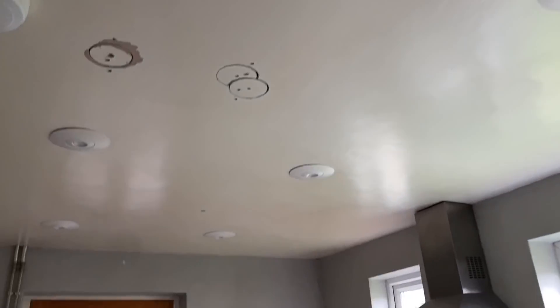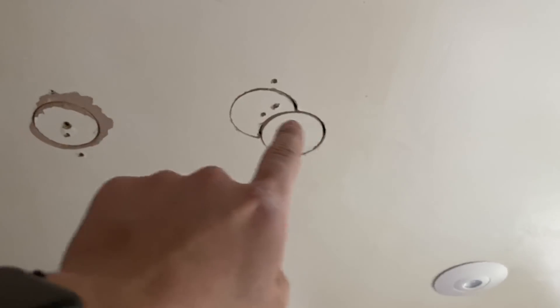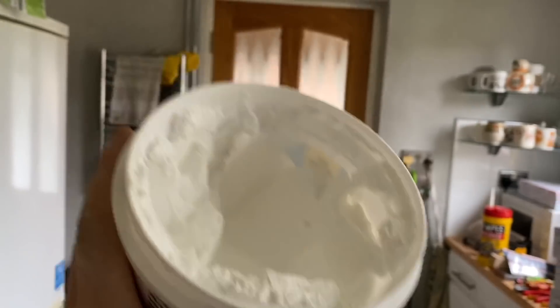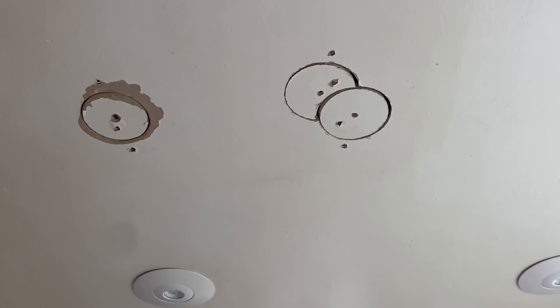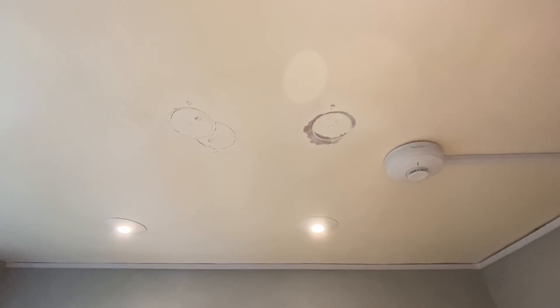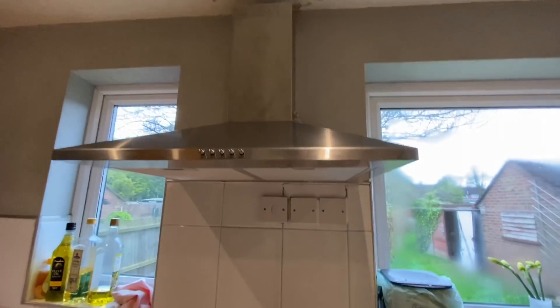All the new lights are now in — much better. The junction box up there is maintenance-free and I've put a bit of wood behind and screwed those pieces of hole-cutter back in. I'm just going to fill those holes with some one-hit filler and then they'll be ready for a lick of paint. The lights look much better — nice and bright. I've also put a new cooker hood in because the buttons and the extractor were all broken and live parts were exposed, and I've siliconed around the fused connection units to improve the IP rating.